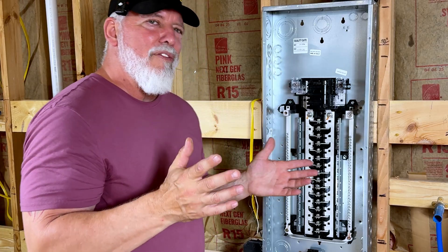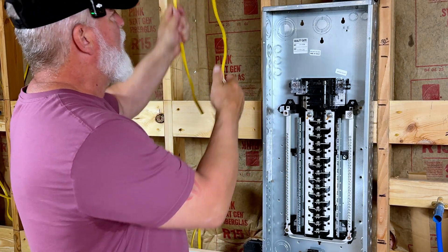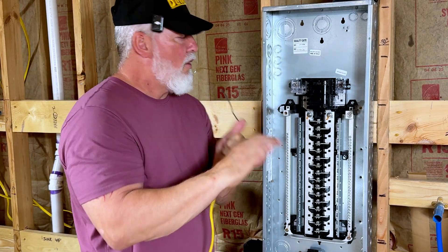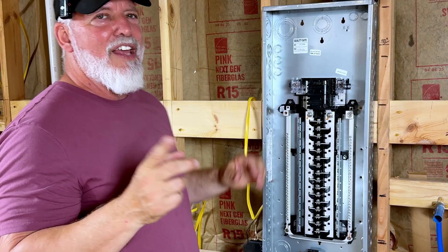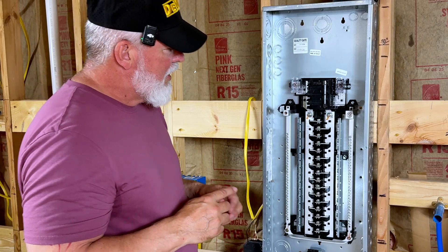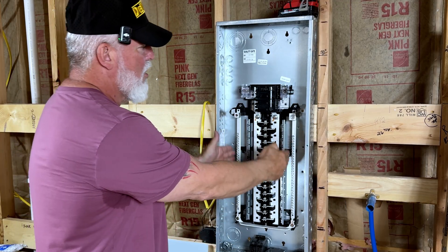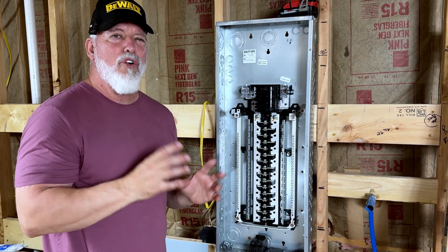If you're dealing with a main panel, you'll have a spike ran into the ground and a bare wire coming up. This is your Romex — you'll tie an earth ground to it. This is my common, this is my hot. In a main service panel, the earth ground and common can be on the same bus all the way around — not a problem. When you get to a sub panel, that changes — we'll look at that in a future video. If this is the main panel outside, it has a bonding screw location. You put a green bonding screw in and it bonds the box to the common and earth ground connection so everything is grounded. If it is a sub panel, you remove or do not place that screw.